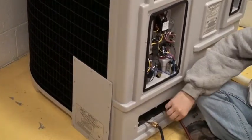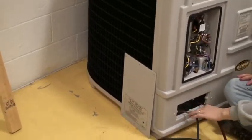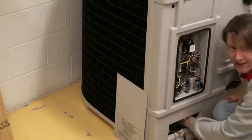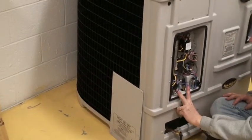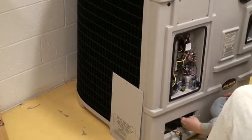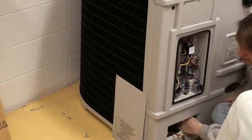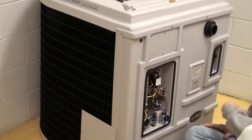That one's a different style. This is the way we ship them now, with the hole, because I've begged and pleaded with them long enough. How were the older ones? On the older ones, these two things came up. So with this hole, now you can actually change the thermostat. If you reach in far enough, you can get to the back too. You can pull the thermostat out.